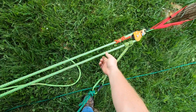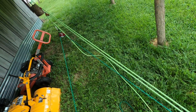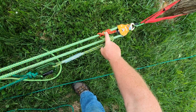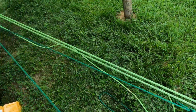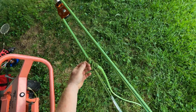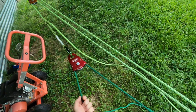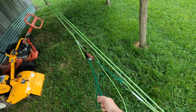The darker green line is attached to part of the 3-to-1 with a pulley at the tail of the 3-to-1. Here's your load strand coming in, here's our progress capture — this red prusik — and the darker green strand coming around the pulley comes up and does the classic 3-to-1 with a rope grab up here. This is the tail of the 3-to-1. Then we have another rope grab here with a pulley; this green line, which started on the middle strand of the 3-to-1, is captured right here.